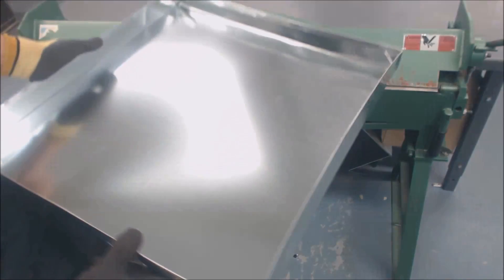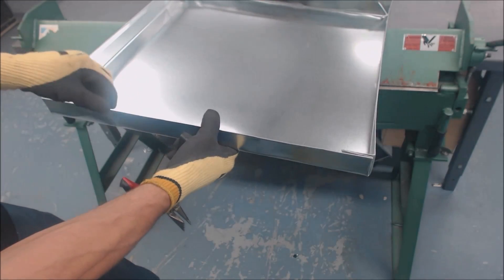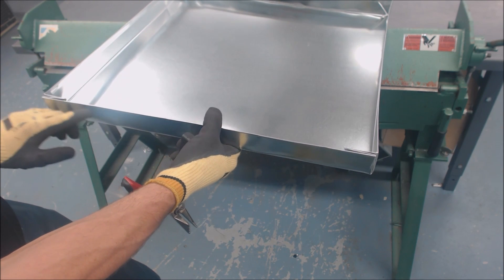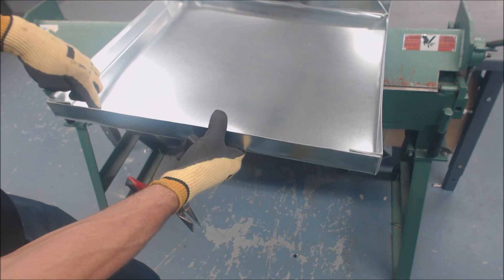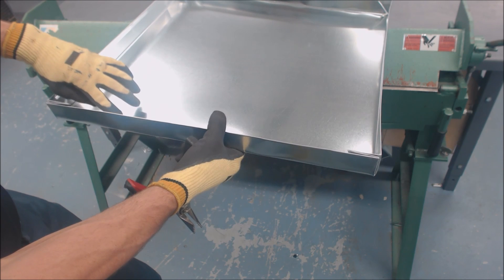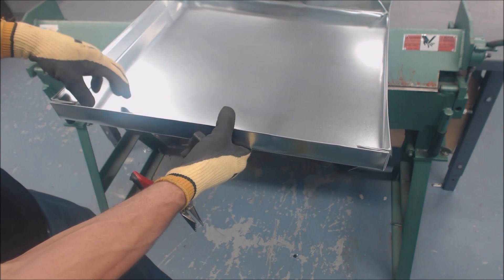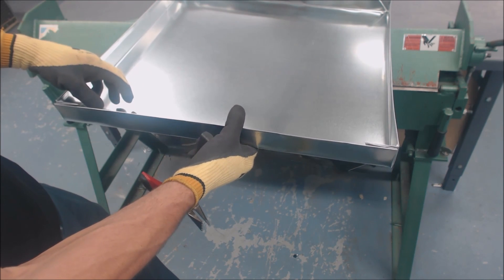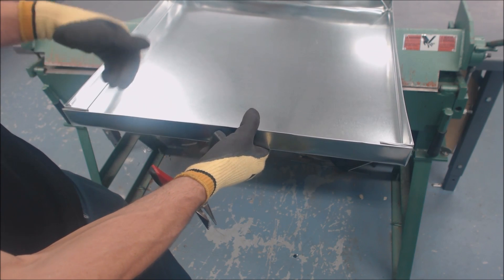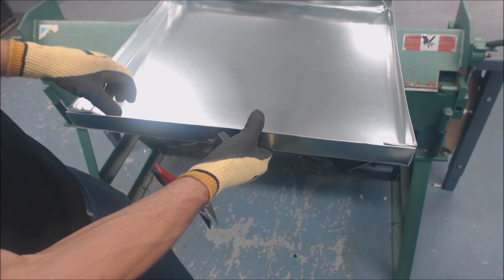This will trap all your water. You can put an emergency condensate float switch inside this pan — mount it right to the side with tension clips, no need to screw through the pan. Put some sealant around the edge. Set the float switch so it's just slightly ready to trip if there's even a slight bit of water. You want a float switch with as much styrofoam as possible — don't use those hollow plastic ones. You want the big wide styrofoam ones.